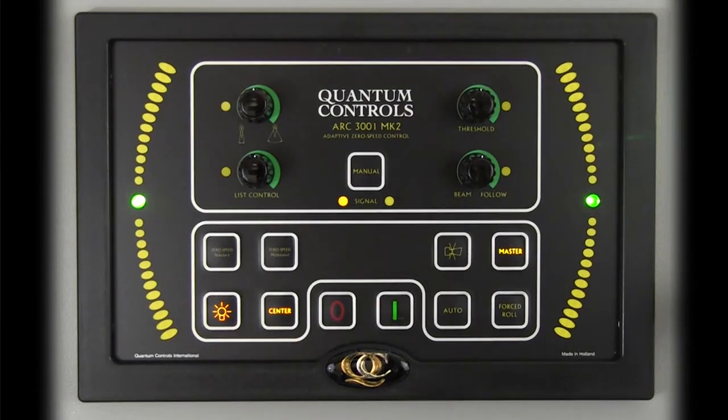The ARC-3001 is able to display several hydraulic system alarms. When an alarm is triggered, a symbol for the alarm will illuminate, such as a temperature bulb signaling high oil temperature in the oil reservoir, a fluid vessel indicating low oil level in the oil reservoir, and a filter element signaling the pressure filter element is clogged and operating in the bypass condition.